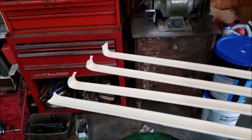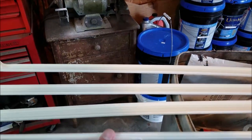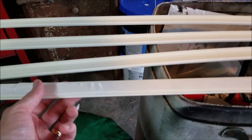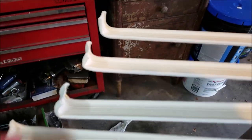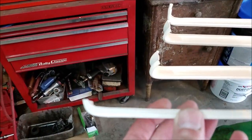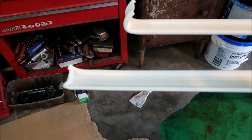Ok, this is just an experiment. I'm going to try to make some gutters for my rooftop air conditioners on the RV. This is a wire track you stick onto your wall - it's got a cover you put on top to hide your wires. I took a heat gun and bent these up to make a 90-degree angle, then took it to my grinder and ground off the excess to make a little trough. That will fit right up under my drip pan, catch the water, and run it off the side of the RV - that's the plan.